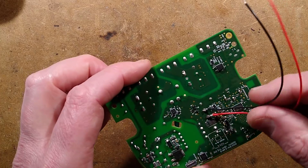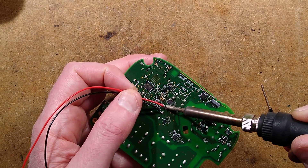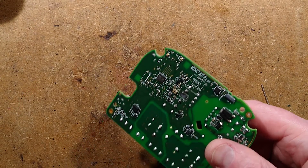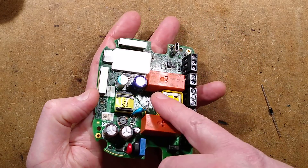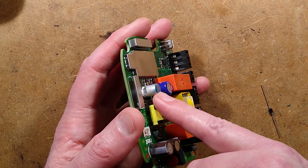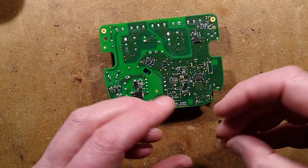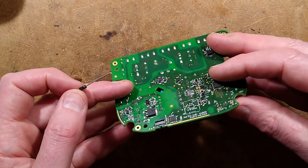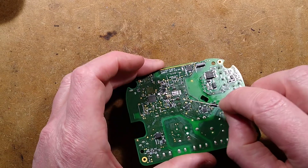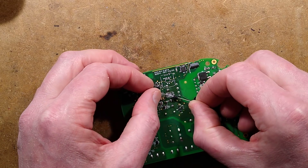Now I have to work out how to get this diode into that cramped space. I think I may just sit it across the circuit board. I'll get rid of these connections and my little jumper wires. Interesting: I think that diode was deliberately overrated to produce a reliable product, but unfortunately it backfired — that particular diode was not reliable. It's also notable that these two capacitors are different styles and different brands but the same value, and they're in parallel — possibly as built-in redundancy in case one turns out to be a duffer. I want to keep this away from the RF section over there, so I don't want to disrupt that area. I could solder one end onto this big pad and the other one directly onto the pad of the transformer — I think that's actually not a bad option.